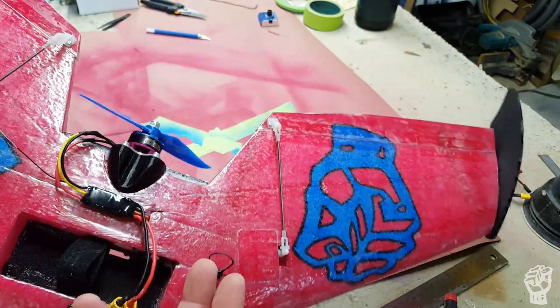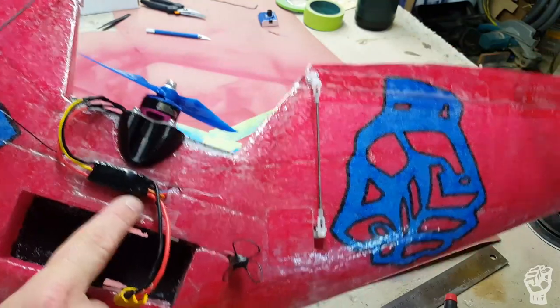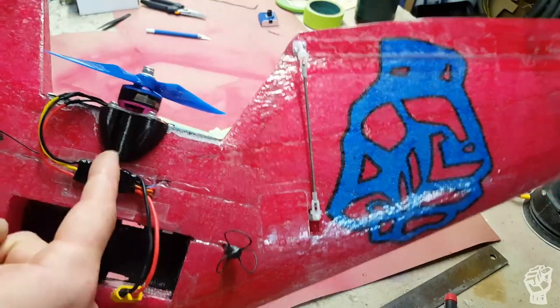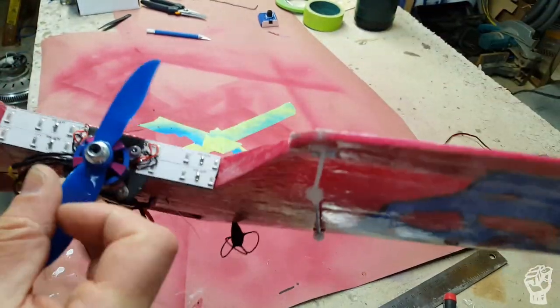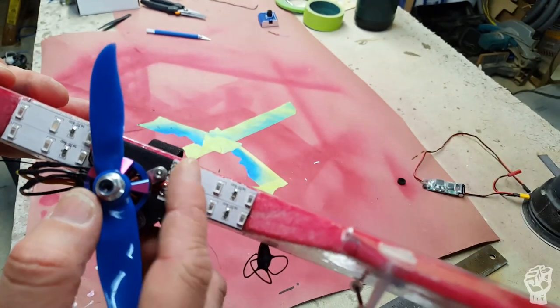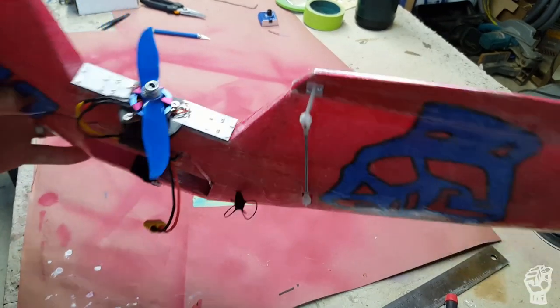The speed control has wired up to it a 5-volt regulator and a 12-volt regulator, and that's buried underneath this hatch here. I actually plucked out some foam underneath the mount and put the regulators in there. You can see I wired on some LEDs there in the back — they're just 12-volt LEDs, that's why we needed the 12-volt regulator.